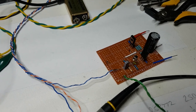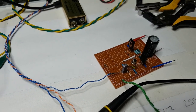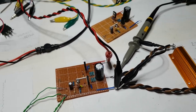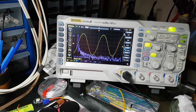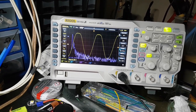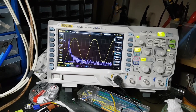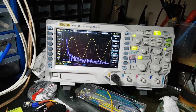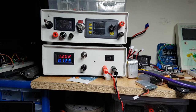It's got exactly the same components - even down to the carbon resistor used there, as I used a carbon resistor on the first one too. That was actually the first one I built, and that was the second one. So that's the other channel, and it's probably just as expected. We can see it starts to flatten out the top first before it starts going at the bottom. Let's take that down to about 2 volts - yeah, pretty good. We're doing about the same sort of power, maybe a few extra milliamps on there, but I don't worry about that too much.